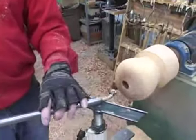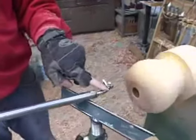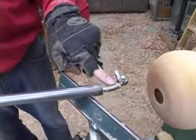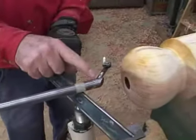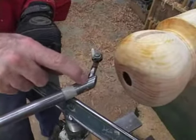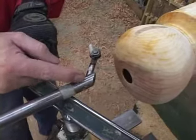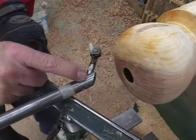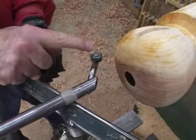So now I'm going to show you a third option that you need to develop. The first option was a straight cutter. The second option was a little bend. Now I'm going to show you the big hook tool capabilities. What I've done is I've just drilled a 3/4 inch boring bar with a hole on a 45-degree angle in here, and taken the swivel assembly out of the other end and put it in this end so that we have a large reach over to the side.